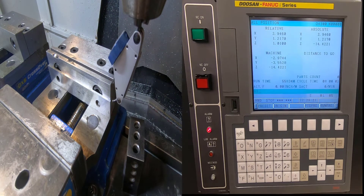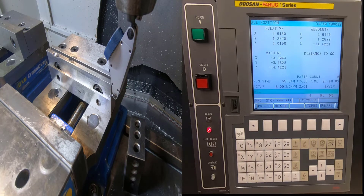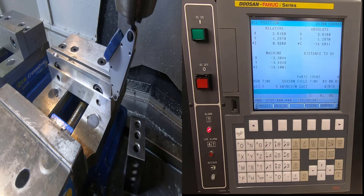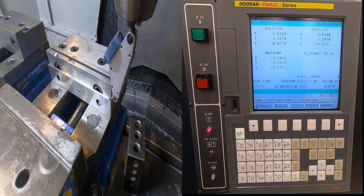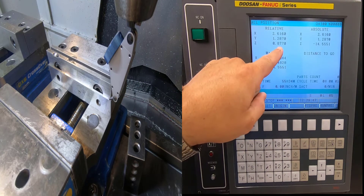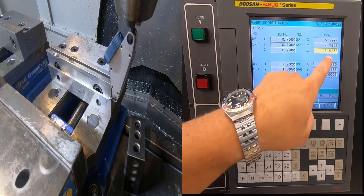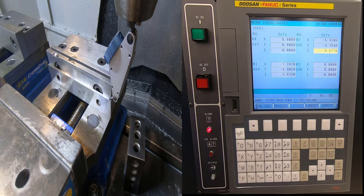I come up, and here's why I'm using the dial test indicator. I'm going to touch off the top of the 1-2-3 block to get that distance. I rotate the dial test indicator bezel, come up, and touch the top of the 1-2-3 block — be careful not to bump it or you have to start over. I come down the same half-rotation to the 15. Looking at my screen, my relative Z reads 877 thousandths. This number is the distance from the 1-2-3 block to the top of the parallel and must go into my work offset.